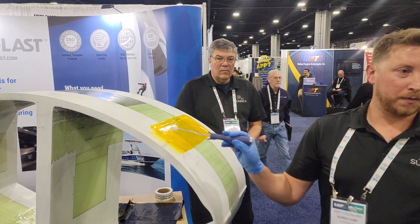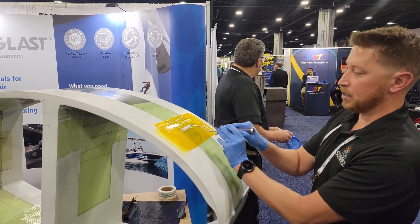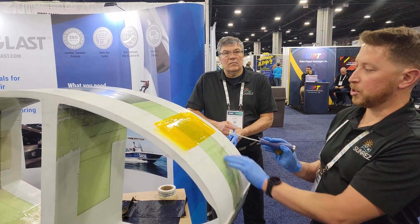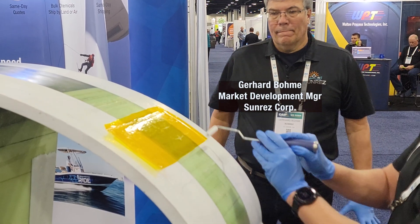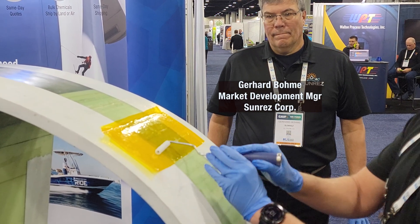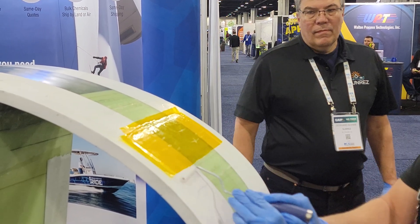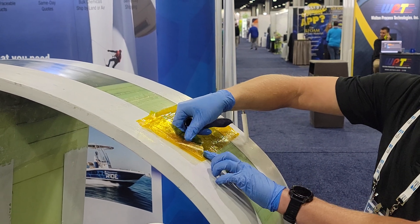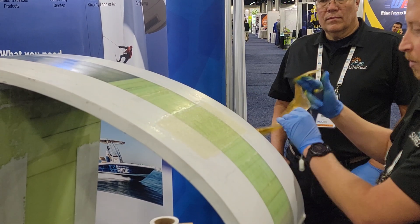We're leaving our UV blocking film on top for this section, but as you'll see when you start to actually compress and remove that air, you have a really nice difference between the color of your parts. You know you're getting good consolidation when you're not seeing any of that air in between the parts. Roll it out nice and quick. We're going to be sure that when we're removing there's a clear film underneath here as well, so as we're building up more and more layers we're going to remove both sets of films.